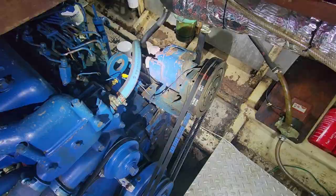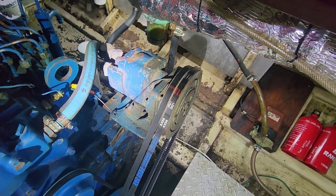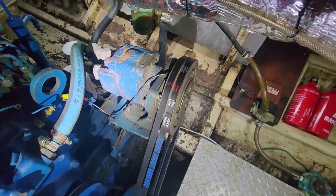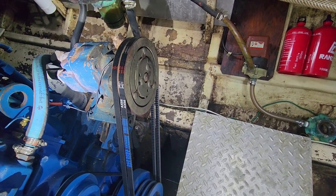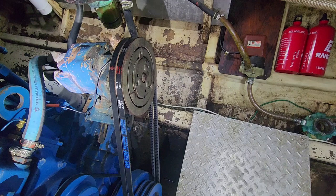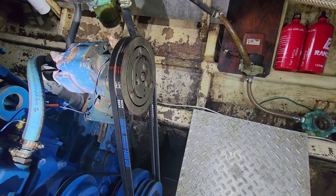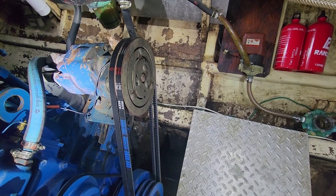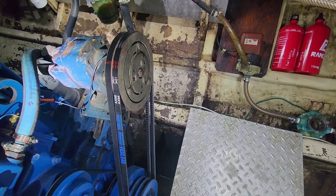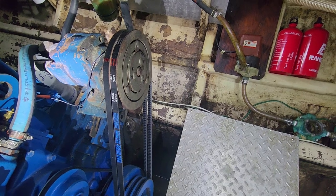This is a hydraulic thruster. It has an additional pulley on the front and a big magnetic clutch — you can see the wire going to it. That magnetic clutch is very similar to what's in the air conditioner of your car. You apply voltage to it, there's an electromagnet in there, it pulls in, and the inner part begins rotating. The outer part and belts rotate all the time the engine is running, but once the magnetic clutch is activated, the inner part begins running too.